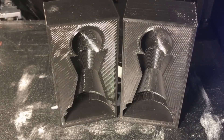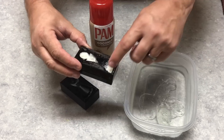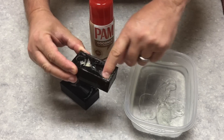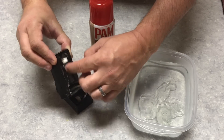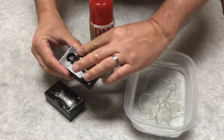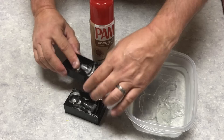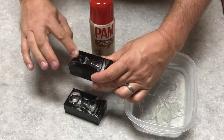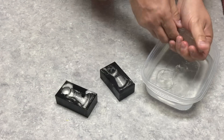About that time the prints from Tinkercad were done, so I got my mold. What I did is take that old iPad stand, put it back in the water and softened it up — that's what's in the little bucket. Then I took some PAM coconut oil spray, which is really greasy, and sprayed it on the mold hoping it would work as a release agent. I spread that throughout the mold. I tried a little piece of Instamorph and it seemed not to stick, because without it I had tried it on PLA and it just bonded.